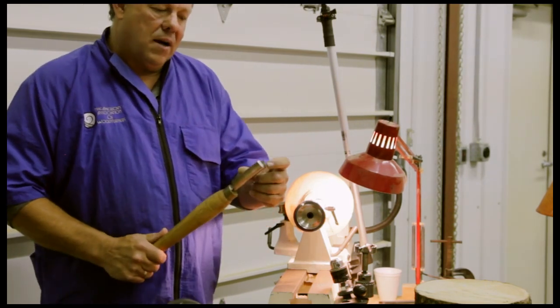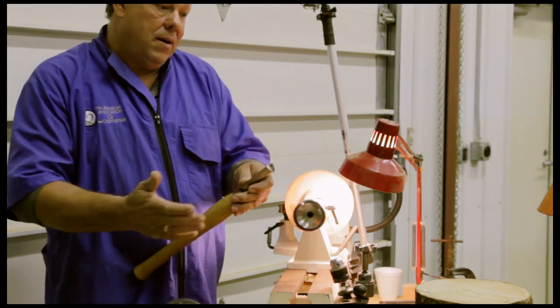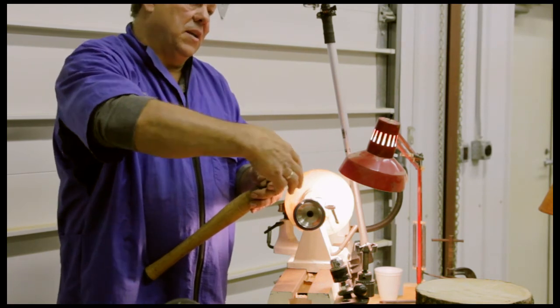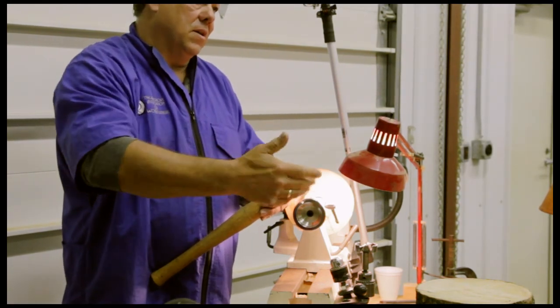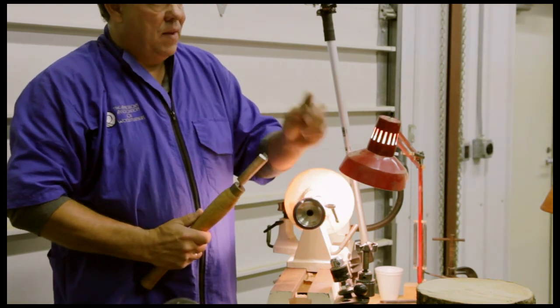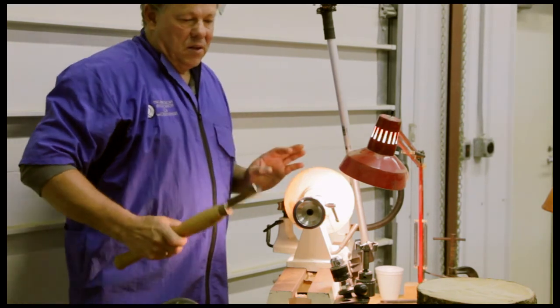And I'm actually not going to cut right in the middle. I'm going to cut slightly on the right hand, my right hand, uphill edge. That's important. That way when the wood's coming around, it's slicing it at an angle, and it's going to give me a smoother cut. If I cut right in the middle, I'd be doing a peeling cut. But if I move off to the right just a little bit, going downhill, it'll be more of a shearing cut.